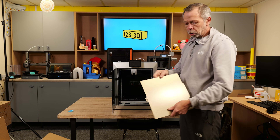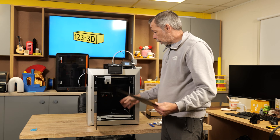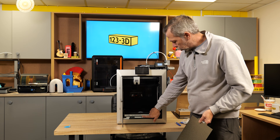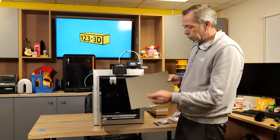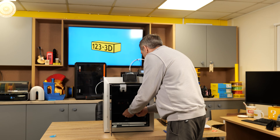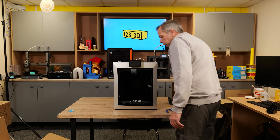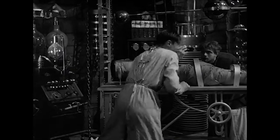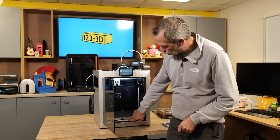The other end of the PTFE tube simply press-fits into the top of the extruder. Opening the door, we get our build plate ready — it's a double-sided flexi PEI textured build plate measuring 280 by 280 millimeters, which is slightly larger than some of the competition at this price bracket. We power on, and the print volume displayed on the heated bed is 270 by 270 by 256 millimeters.